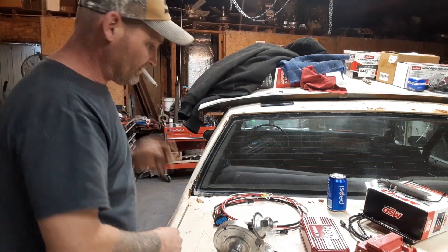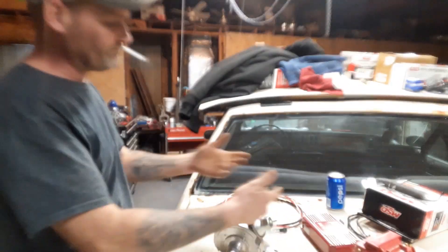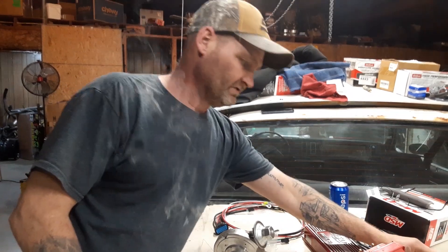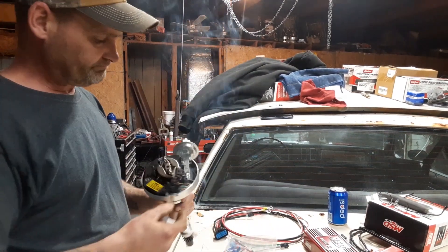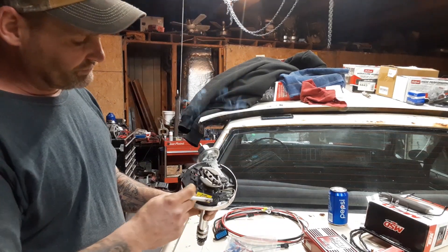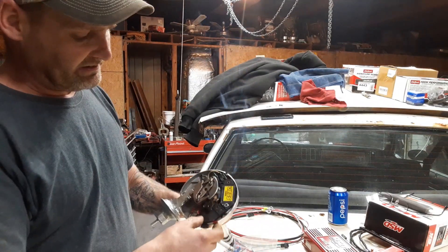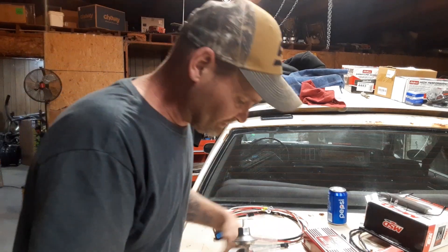White is another cutoff thing, but there's no adjustments on this box. So you start by taking the cap off and taking your rotor button off. Now inside your distributor it looks a little scary — all of this has to come out. Two screws here. The newer ones have screws because they've got a dampener.